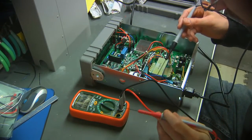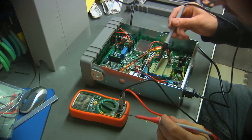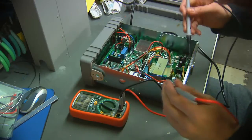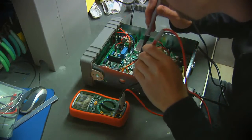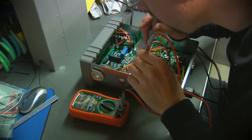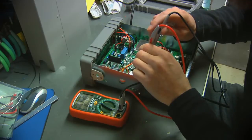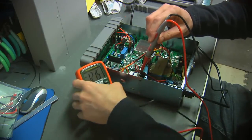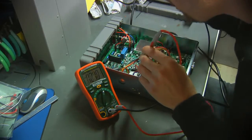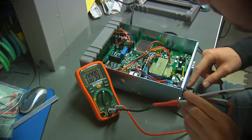So from tracing the wires out, you can see that coming straight off the IEC input, they connect over to this main board on this little 2-pin connector. I don't see any switches in between, so any time that is plugged in, there should always be AC voltage here. In fact, there is. I see 120 volts. Probably kind of hard to see there with the glare. There we go. So that's all well and good. Not really testing very much there, though.